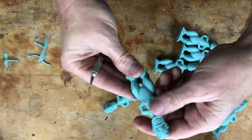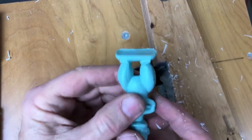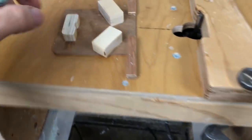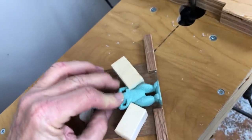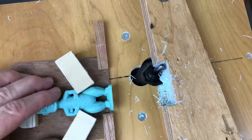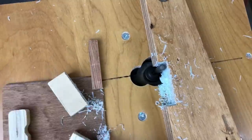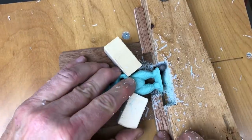These look great. They are going to be so easy to clean the flash off — absolutely fantastic. When the castings come out of the mold the bottoms are not flat — they kind of shrink, they kind of cup in. We want them to be nice and flat. This is my beautiful little homemade router setup. Got this jig which was built special for this job — it just holds those things in place and works like a champ. This is just the easiest and simplest way I've ever found to machine the bases of these little pieces flat. It's so much faster than trying to do it by hand, and while it is a bit of a pain to build the jig, the return on investment in time is a no brainer. Fast, simple, accurate — it works every time.